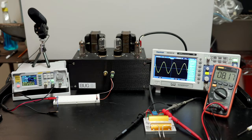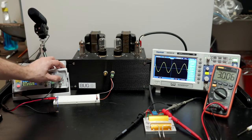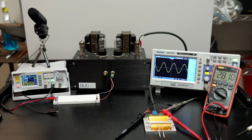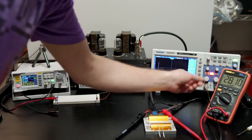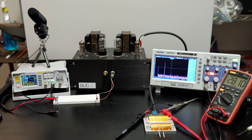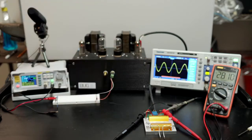Let's go back down to 1 watt — that's a better place to test things like square waves. At 1 watt, let's take a quick look at the FFT. You can see a little bit of second-order distortion creeping in at 1 watt. We'll take a much closer look at that when we get the computer out.